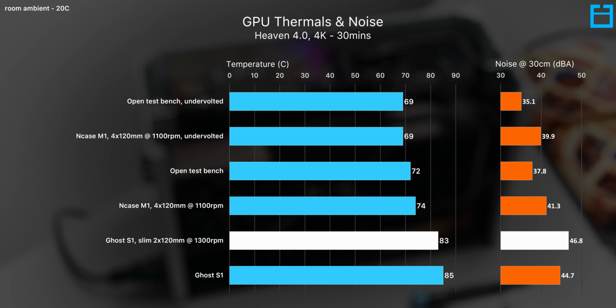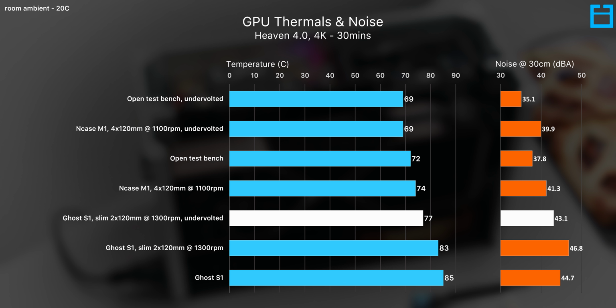And with the small top hat, we do get a big improvement. It's still very warm for a card that shouldn't be, don't get me wrong, but the 3080 is now running at the full 320 watts with no throttling back. We can further reduce this by enabling our undervolt profile, and that brings things down to a much more reasonable level, 77 degrees C now with a much lower fan speed and noise level too.